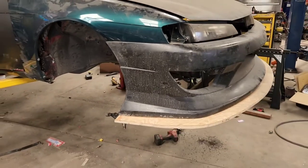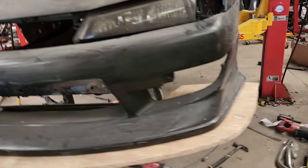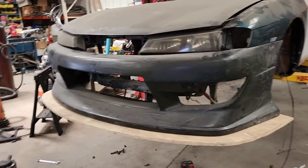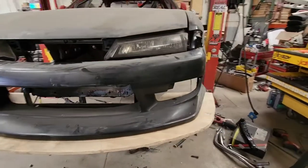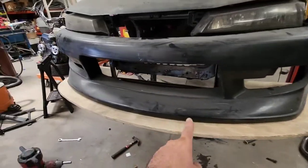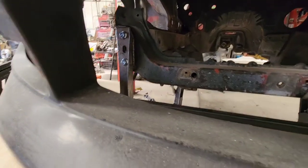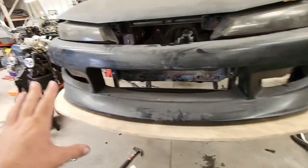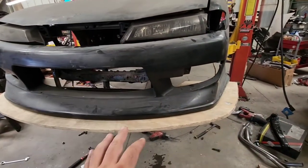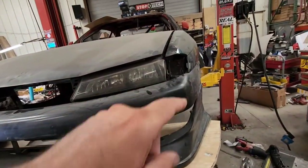I have skipped some steps here, but the splitter is mounted to the frame, and the frame is mounted to the chassis, and the bumper is just sitting on there for right now. Splitter here is super easy and cool for the fact that it holds the bumper up, keeps the bottom from sagging, and if I have to pull it into a trailer or onto a trailer and the splitter's gonna hit, all I have to do is reach in with an impact or a ratchet, undo the three bolts that'll be there, and the whole thing, the whole bottom, even if the bumper's attached to it and not the fenders, will remove as one piece. This also helps keep weight off of the sides of your fenders.